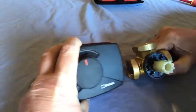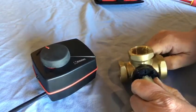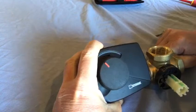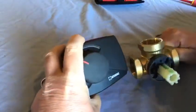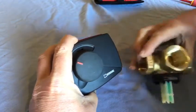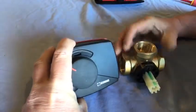As we can see on the valve head it's turning to the left, so the groove is going to be at the top coming in here, and all we're doing is turning 90 degrees between one port to the other. In this setup this is now in a hot water position but the valve is blanking our hot water port, so it's incorrect. We'd get heating when it was in hot water and hot water when it was in heating.